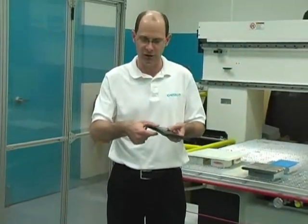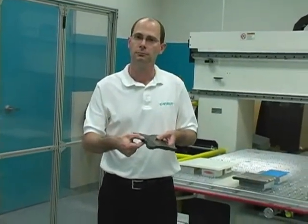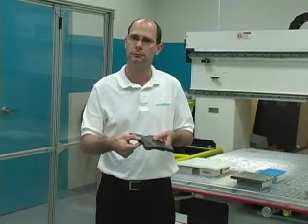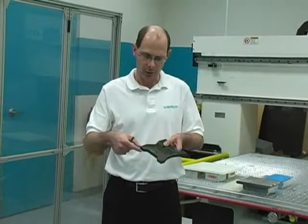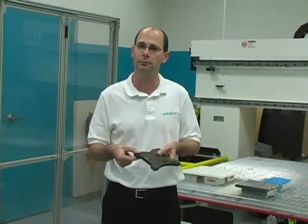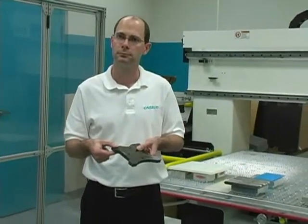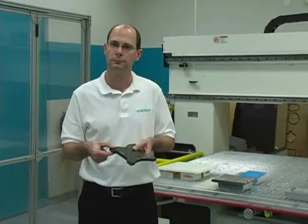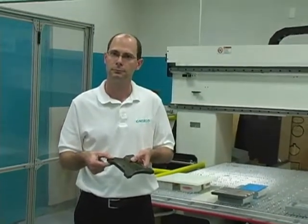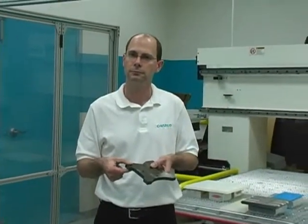This is a very dense material with strong fibers that are hard to cut. You could use a solid carbide tool to cut that material, but it may not last that long. Solid carbide will cut a couple pieces, but then the tool will begin to dull. A step up would be coated solid carbide, either a traditional coating like AlTiN or even diamond film coatings. Those are increasing in popularity with composite materials. But for longest life, you want to use a PCD, which stands for Polycrystalline Diamond Tool.